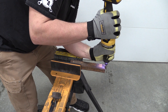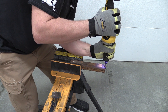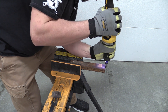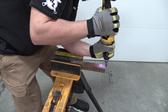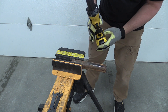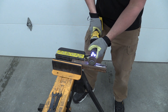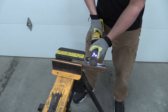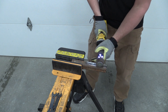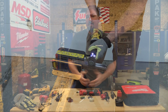To compare, I used a DeWalt 20V with a four amp-hour battery — this is apples to oranges, but there is a huge difference. Even using the burring tool on the DeWalt at 10,000 RPM max, it was very comparable to the M12 on full speed. Switching to the two-inch flap sanding disc showed a night-and-day difference. To Milwaukee's credit, the DeWalt did cut out twice under heavy pressure. There is no doubt that 18V and 20V die grinders are going to be more powerful, and that should surprise absolutely no one.